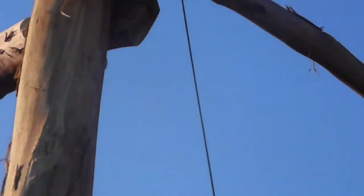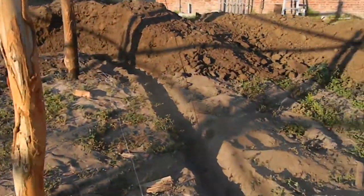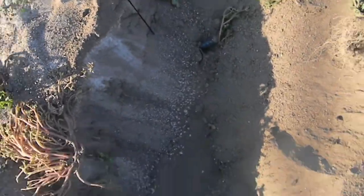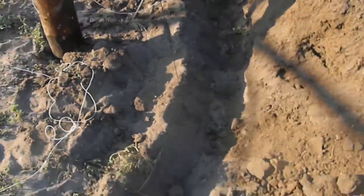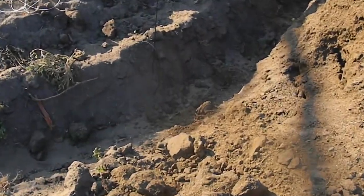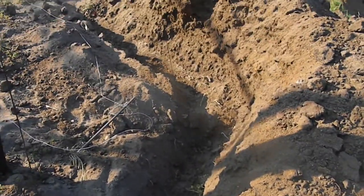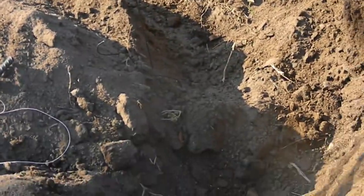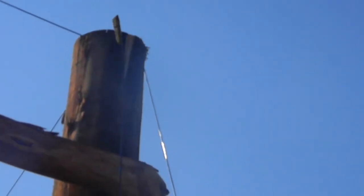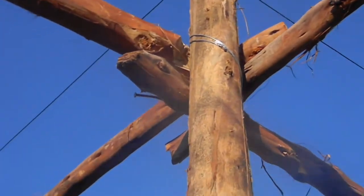The next stage is to sink metal rods into the ground as pegs where our poly wire will be tied to. These rods should be about 1 meter away from the upright poles and in the trench that we have just dug. Now use a normal tying wire to further strengthen the joints we previously fastened using 6-inch nails.